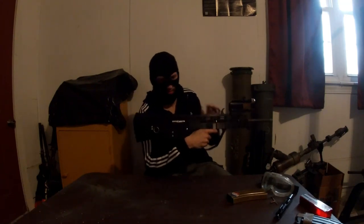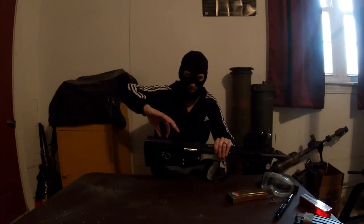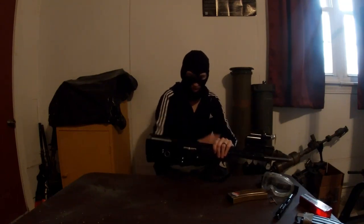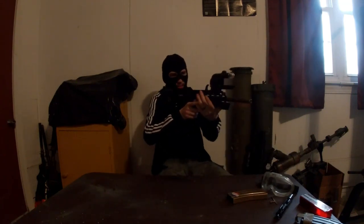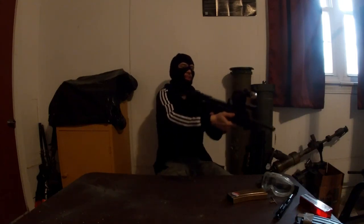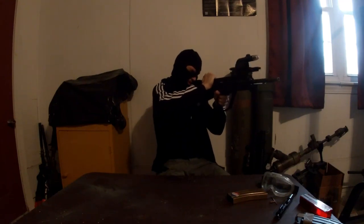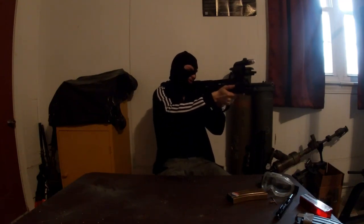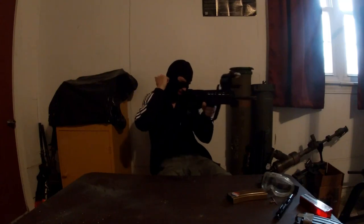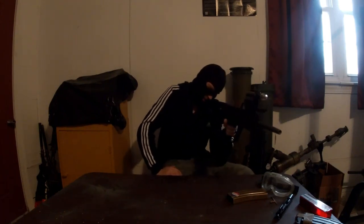For overall length, I'm using a 3.5-inch AR-15 buffer, and I did have to add roughly an inch of length on this part. So with an 18-inch barrel, as opposed to 19 like the real FAMAS, you get about the same overall length. This added length of pull I actually find convenient because my hand wants to come off the end — I love this little finger stop. If I keep my face off the cheek rest, like I should, and come back here — kind of like on a Steyr AUG — if you pull it a little bit further forward, you can actually fire it on your offhand without eating brass.